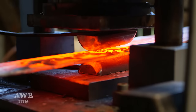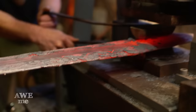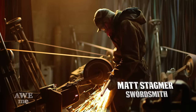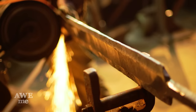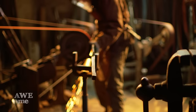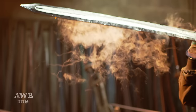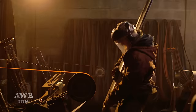Using two and a half inch round fullering dies, Sam forges in the fuller in the center of the blade. I will later use a grinder to true this up, but he's going to rough in the shape to save me a lot of time. The double helix Zelda sword was the most complex shape I've ever had to grind, but this is by far the heaviest blade I've ever attempted. This process is going to take me a couple of hours, so I move slow and steady to make sure I don't mess up. I've removed about 10 pounds of metal from this blade already and it's still really heavy. Now that I have my central fuller ground into the blade, it's time to do the edging. The massive length of this blade is a real challenge — I brace the blade on my shoulder and slowly pass it down the grinding wheel.